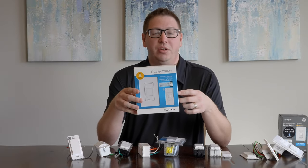You might see some switches that have dimmers built in. Some are going to have smart speakers — I would stay away from those; the sound quality is not there and they end up picking up things when you don't want them to. But there are a number of switches that can actually control more than one device, so those are going to have two load wires coming out. If you have a fan and a light in the same spot, or controls for two different loads, you can achieve that in just one switch.